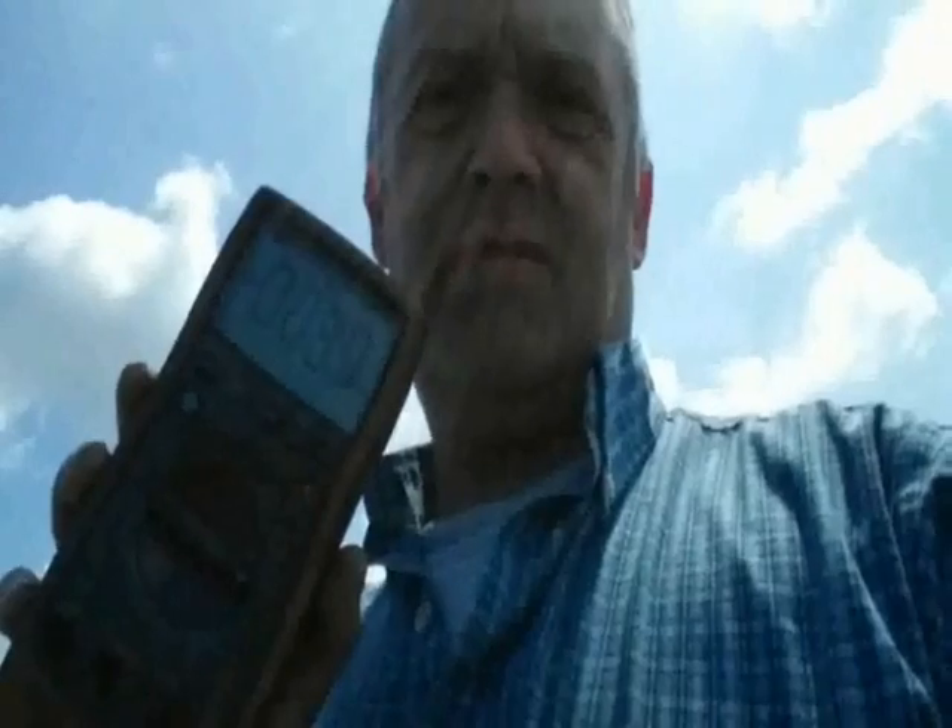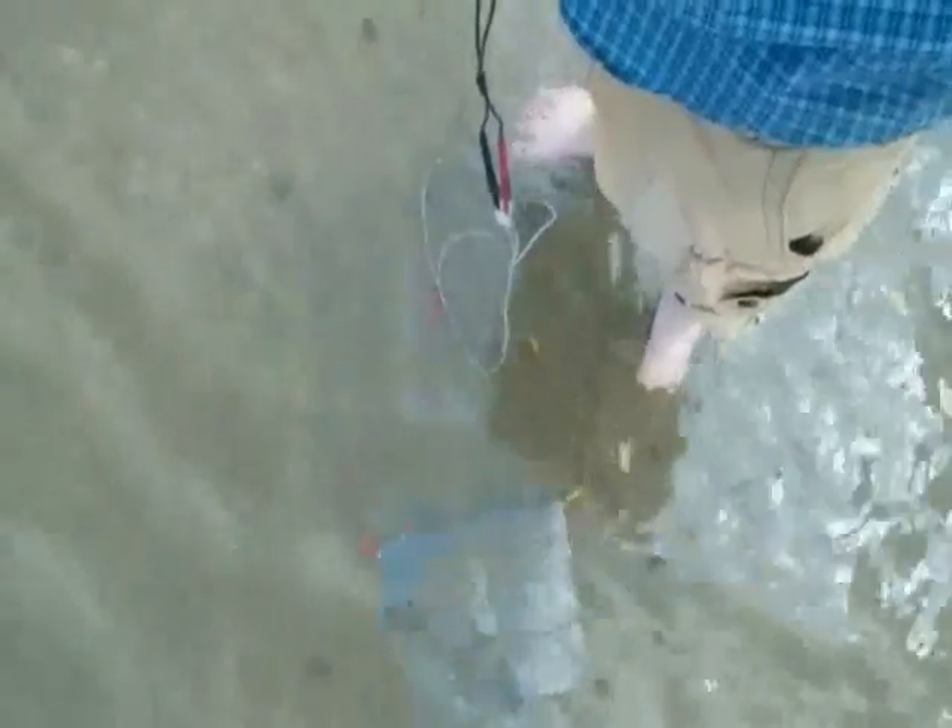The second sheet works as well — we're getting around 7 millivolts, skipping between 6.8 and 7.5, which I guess is the wave action. They're just laying underneath the wave. This one doesn't have the copper strips on it, so it's only collecting from the portion it's clipped to instead of the whole sheet — but that's pretty cool anyway.